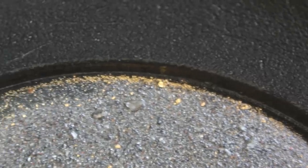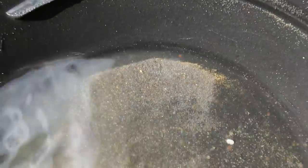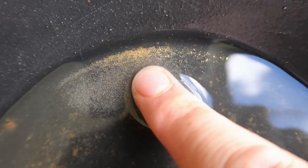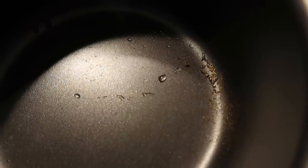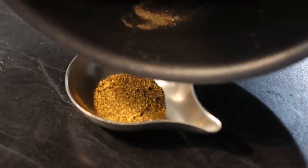That is a very nice smear of gold, and this is why we have to re-crush it. That silver material is going to be a mix of iron sulfides as well as steel off the crusher. The gold from this ore is so incredibly fine that there will be grades we visibly can't see - you would need to use chemical extraction or smelting to extract all of the gold. I don't like chemicals, but I do like fire. This is what we got out of the first bucket and this is what we got out of the premium ore. We're drying off the gold we recovered from what we sampled, then we'll be adding it to the 3.8 grams of gold we had already recovered.